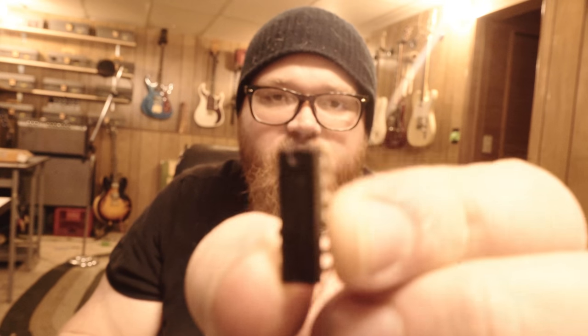If you notice on pretty much any chip that you see, there's a little notch in the top. Let me show you with this. So basically this is the way our oscillator or any chip works. You have your chip, that's a good rectangle, right? There's a little notch at the top that indicates that's the top, which then means on the left side, this is number 1, 2, 3, 4. Now then it goes around like this, 5, 6, 7, 8. So these are the numbered pins. So when you look up the chip, they'll say, okay, pin number 1 is power.